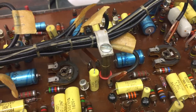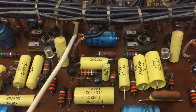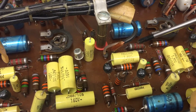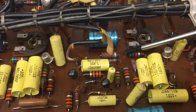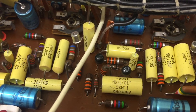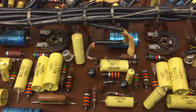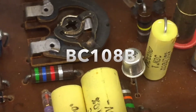It's maybe not a great idea to change out all of them, but maybe some of the biasing resistors — like this 2K2 here — seem a bit discolored, and the same is true for this one. It's probably connected to the power supply for the transistors. The transistors are BC-208, and there are also metal cap transistors which are BC-108B.